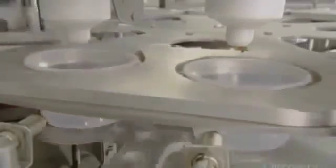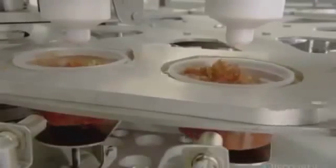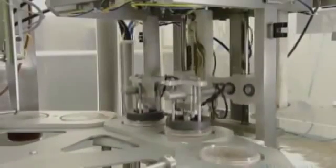The finished salsa goes into vats. From there, at packaging time, a pumping system moves it to the automated filling machine, whose nozzles squirt the required quantity of salsa into plastic containers. The machine then seals each container with a plastic safety film and presses on a cover. This is what the packaging process looks like in slow motion. It actually moves at about twice this speed.